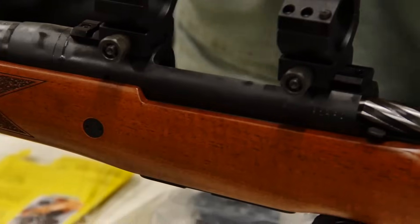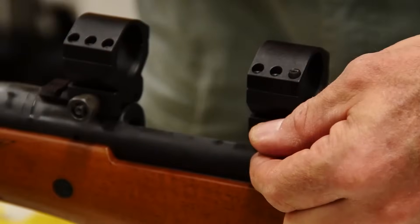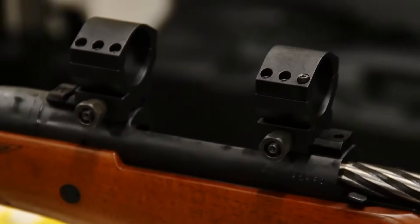I did a little bit more research — it is very good value for the money you're spending. I know a little bit about Mike here doing the install, so I'm not worried that's going to go wrong. It's nice that basically Vortex themselves are installing it on the rifles. The torque driver here allows us to get 40 inch-pounds on the base rings or bolts, whatever you happen to be using. The bottom rings, similarly, are either going to be bolt heads or some kind of a nut — 40 inch-pounds. That's what goes on your lower rings and on the mounts of the rifle itself.